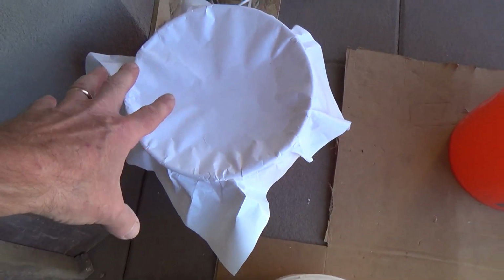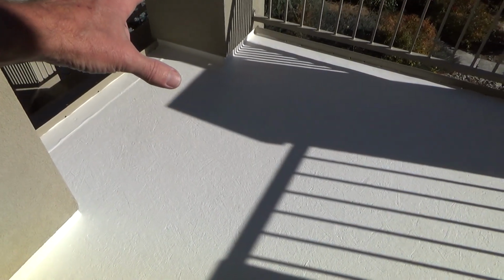If it leaks and eventually penetrates through this and gets down on the floor, that's fine too, because that's where I got my primary flooring material down. This is so that if my floor ever gets some dips and valleys in it, and if the water stays there for weeks on end, let's say in the winter, hopefully it doesn't start affecting and tearing apart this flooring material that I put down, because this is supposed to act like a rubbery base. It's designed to be put on flat roofs, right over existing flat roofs, as a matter of fact. So I've coated this at least 5 times with the roller and rolled it down, so it's pretty thick.